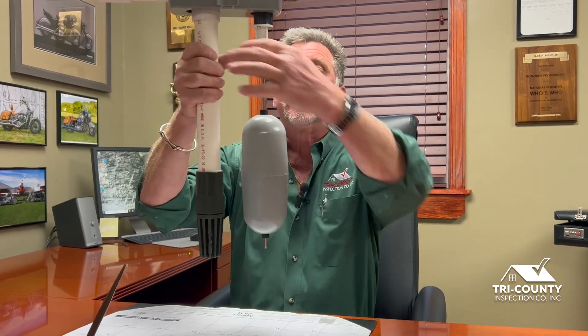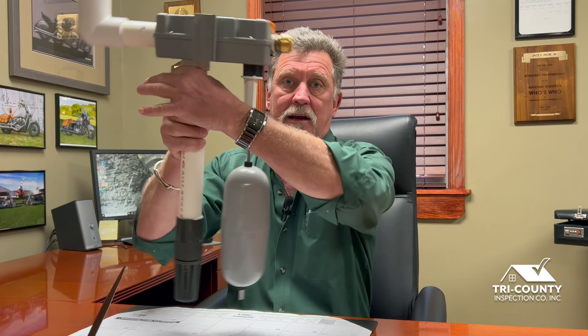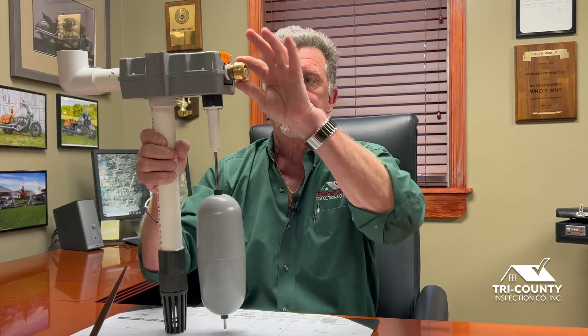It's going to sit in the pit and it does require some bracing so it doesn't shift left or right, and again a three-quarter-inch line. From everything that I've read, SharkBite connections are acceptable. So if you're handy, you might be able to do this yourself, but if not, a plumber can take care of it. If you have any questions or like the content, please feel free to reach out to me at hello@tricountyinspectors.com and push the subscribe button below.